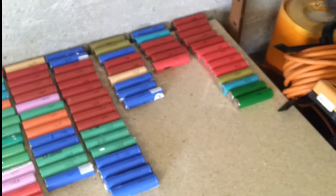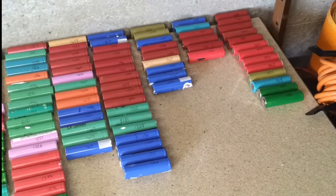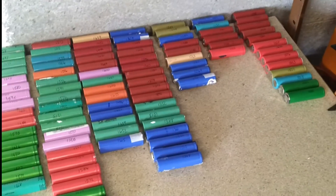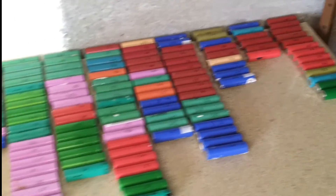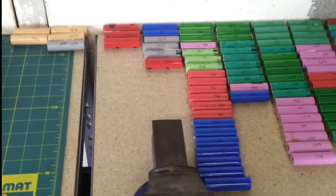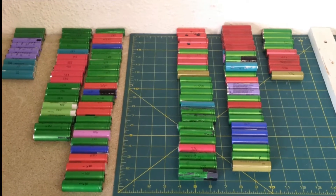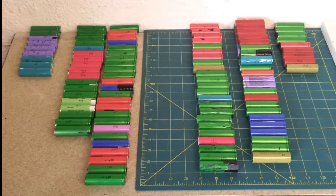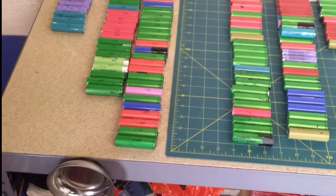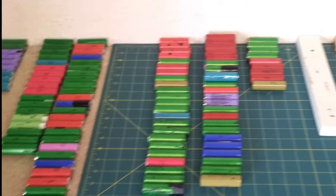At the end I've got 1200s, 1100s, and 1000s — basically just one amp for this section. They're unlikely to make it into the bike unless I desperately need them, but they're probably worth saving at one amp or slightly over per cell. I counted around 158 to 160 in this good pile. But look how many were not decent — I've still got about 10 or 20 to go, and I'm sure some of those will also be not decent. This bad pile here was around about 125.